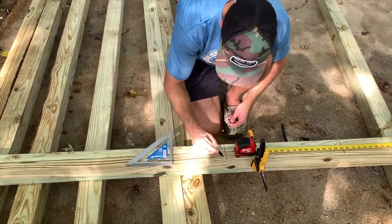So at this point, I threaded the cable through the first stick of conduit and I have the end right there. And before doing anything else with that conduit, I'm going to install a piece of blocking, which is going to allow me to take the conduit from below the deck, put a 90 degree bend on, and then get it below grade. So after making my measurements, I cut my PVC conduit to size. You can use a miter saw or a hacksaw.